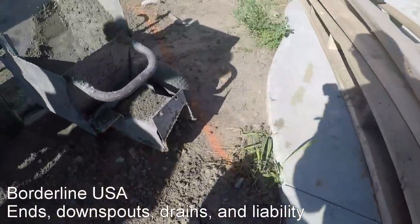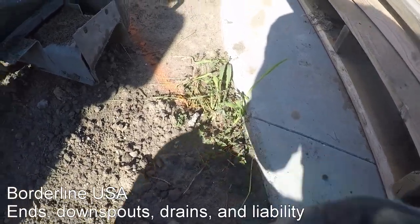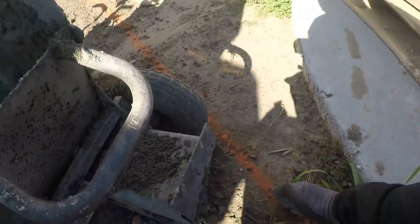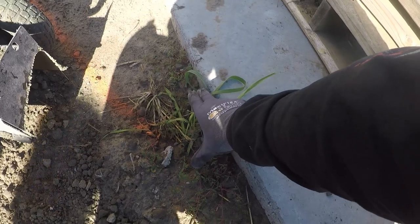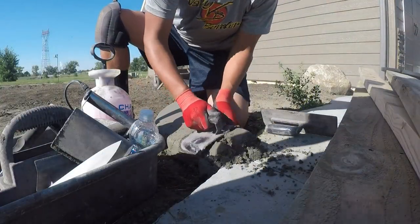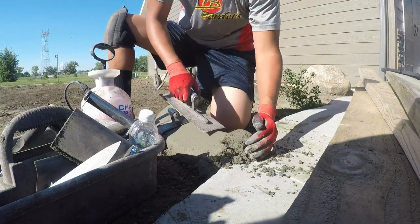The landscaper's got his line painted coming in at an angle right here — that's not something we want to do, because if you come in at an angle to this concrete it's gonna come down to a triangle point right here, which I guarantee is gonna break off in the future. So I'm gonna adjust his line just a little bit, come in more at a 90, and then start to curve so I can get that to be thicker at the end.